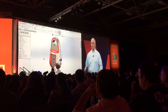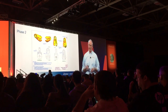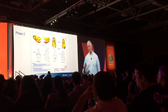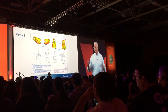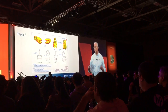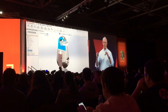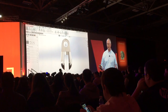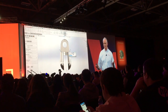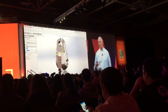As you're done with that, we give you another drawing to make a change. As I mentioned before, those ledges at the top go from planar to cylindrical, and the ceiling at the bottom inside of that pocket becomes spherical. When I look at this, the first thing I think of is a replace face. Instead of having to delete geometry, recreate geometry, add or remove material — which might force some of my other features to fail or become dangling — I'm going to use the replace face option, one of our many tools for direct editing.